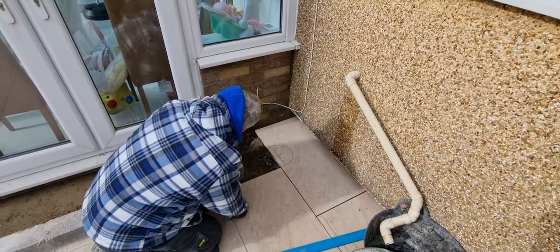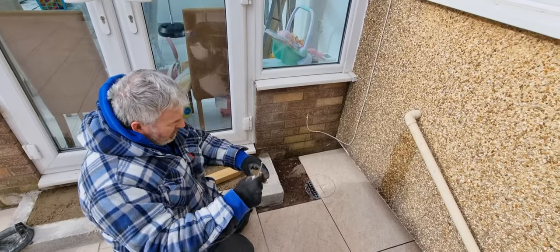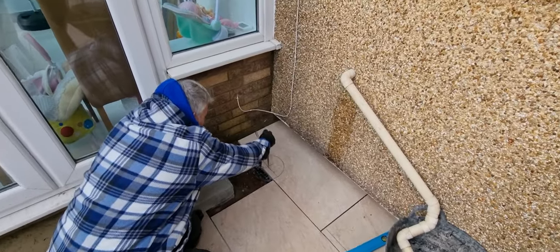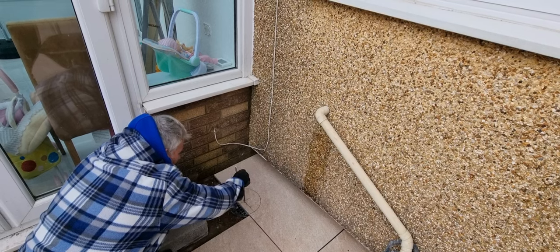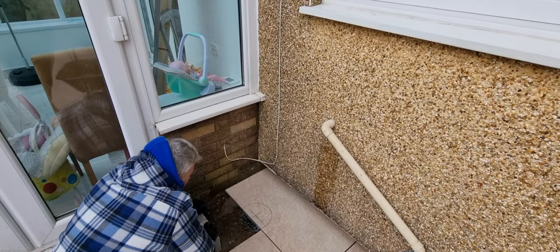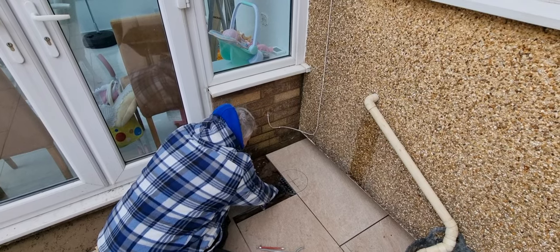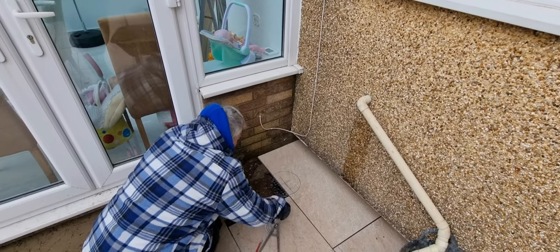There are the dividers - a normal compass probably wouldn't go as wide as you want. What I've done is I've put that on there, laid it down, and put a line around with the compass dividers to exactly where I want it to go. The beauty of this is we've still got the center exposed, so looking down I can see that the curve circle I've put on there is spot on. We'll cut this one in, put it on top, draw the lines, and we've got the two cuts.